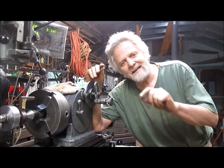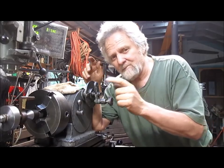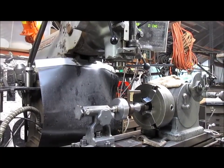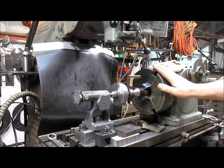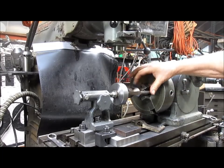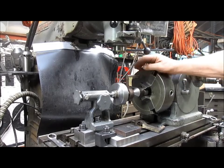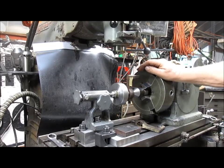Hey, Nick Collier here and today we've got a little mini project — it's actually part of a bigger project. We're getting ready to cut a gear on the divider head, and I've got it centered in both centers, but my lathe dog won't reach. I've got half a dozen lathe dogs and not one of them is going to work in this situation.